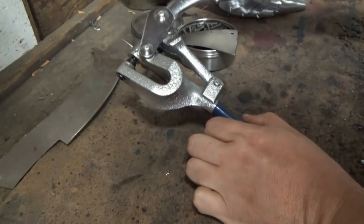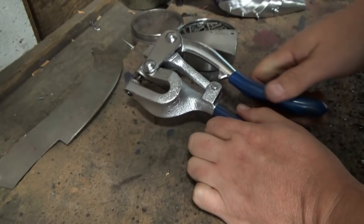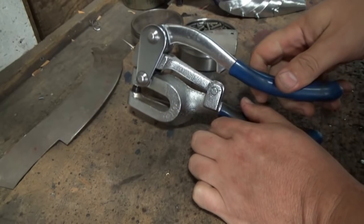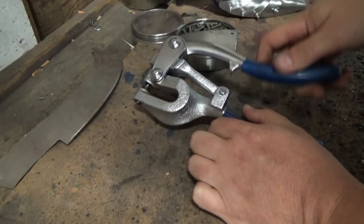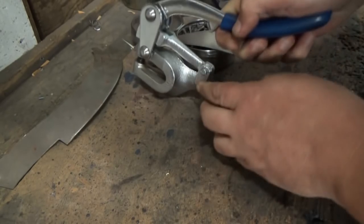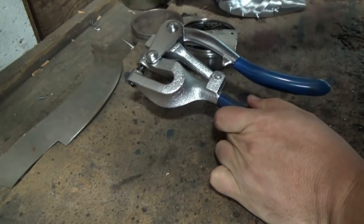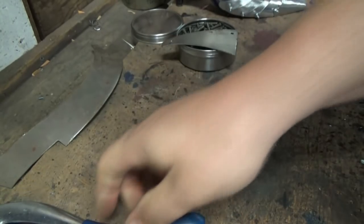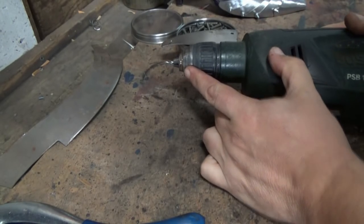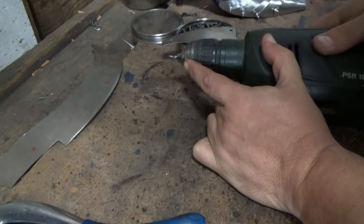You can buy these hole-making tools — these hole punches — quite readily online. They get quite a bad press, quite maligned amongst a lot of groups, but if you stick to the parameters of just using them on mild steel up to about 2mm as a maximum, they'll last you a while. This one is about 8 years old and it's just coming to the end of its life. If you're using high carbon or something along those lines, you really need to stick to a drill and the correct bits — an HSS bit or a carbide drill bit, whatever is required to get through your material effectively.